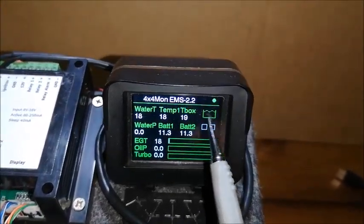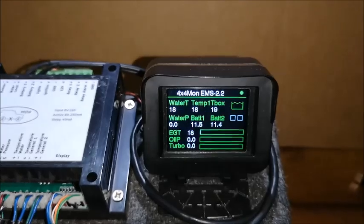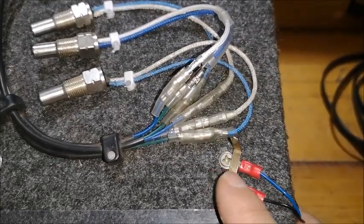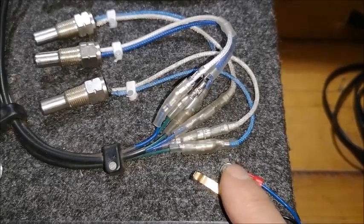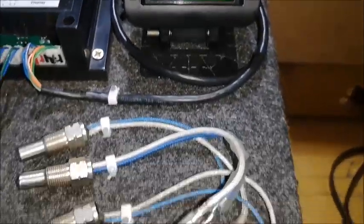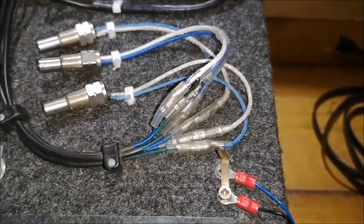Next to the temperatures there's a water level icon. It measures the level of water in the water tank using two small probes that connect via self-tappers into your tank. If the water level is low and the probes are not connected by the water, the unit will trigger and show an error. You can also connect these two probes to a float switch if you prefer not to use self-tappers.